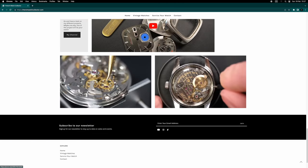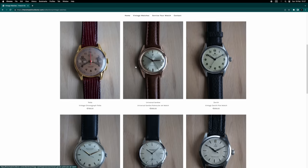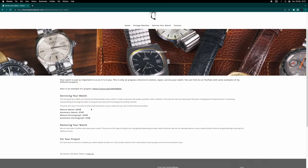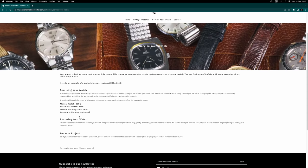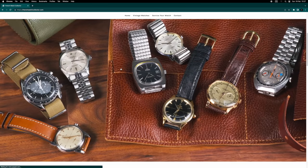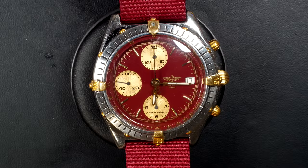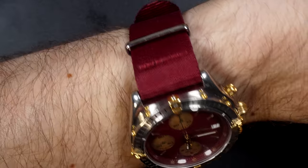I also want to tell you that I have my own website where I'm selling some of the watches I've restored on the channel - you can go have a look, and if you find a nice watch you can reach me. I also offer a servicing service - if you want me to service your watch like this Breitling, you can contact me there. Here is the result on the timegrapher: the amplitude was around 240 before, now it's 320 - much, much better. The watch is almost gaining or losing no seconds per day, with a beat error of 0.1. Fantastic result! This watch will now be running for many years. I hope you liked this service - see you next time!